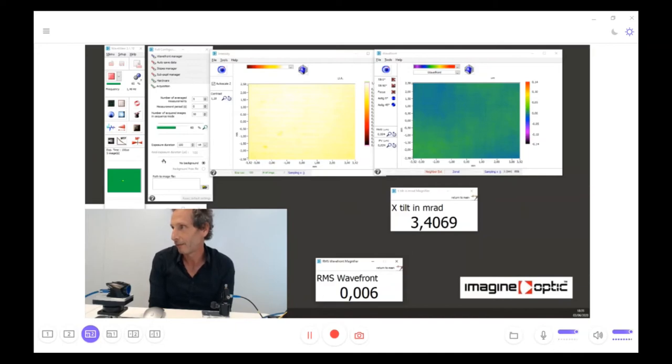The other question is, what is the uncertainty on the measured slope for one subaperture for the whole sensor? And let's take the case of that sensor that you have right now and something like the HASO-HP, just to give a range of different types of sensitivity. Okay, so if we are talking about accuracy, the accuracy is about 10 microradian per subaperture microlens. And in terms of sensitivity, it's much better for sure. It's around 1 microradian. That's for one subaperture.